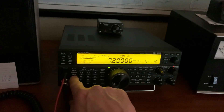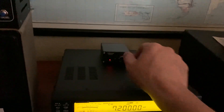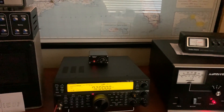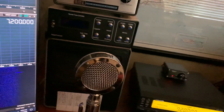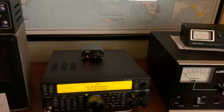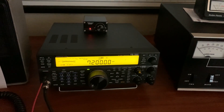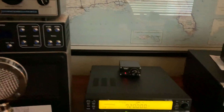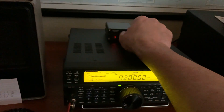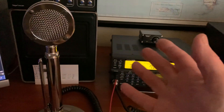Turns out the first part of it was that my audio amplifier — listen to what happens when I transmit. It only happens when I'm on my antenna. When I'm not on the antenna, it doesn't do it. I'm on dummy load — see, it goes away. But the speaker was buzzing bad. And when I'm transmitting on voice peaks on the D104, it's buzzing a little bit too.